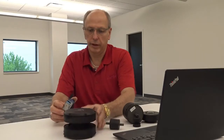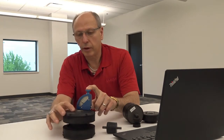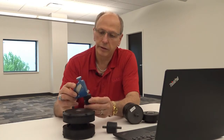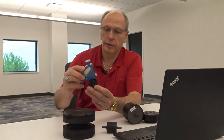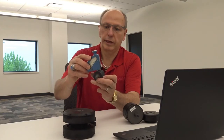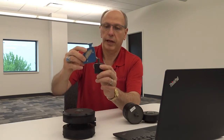Let me give you some examples of what they're talking about. This part is a CB2205 — it has a large enough section where your gauge can measure the hardness of the rubber on the surface. Smaller parts that don't meet that requirement have an issue with the metal sleeve that the rubber is bonded to interfering with the indenter, and you don't get a proper reading. If you try to take the reading on a circular area, you get different readings as it's hard to get the indenter exactly perpendicular to the surface. Similarly, a sandwich mount has the same issue — the durometer changes if I'm not exactly perpendicular and square to the surface, and the top you can't really get in and measure.